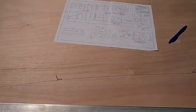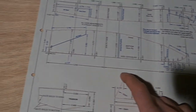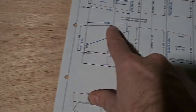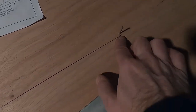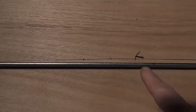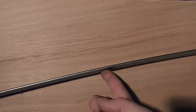I've begun to make the sketch of the bottom — the chine actually — and I've taken all the measurements of this point, this point, and this point. I put in the measurements and on each point I put in a nail. So here three nails, and I've taken a metal strip and put it to the nail this way. It now has a gap; I put it against the nail and now I have a rounded line to draw.